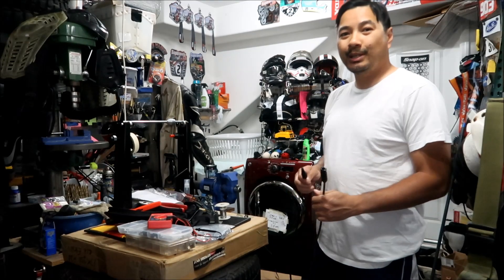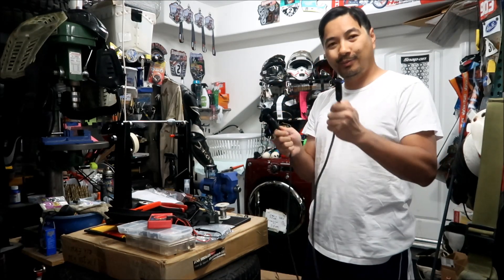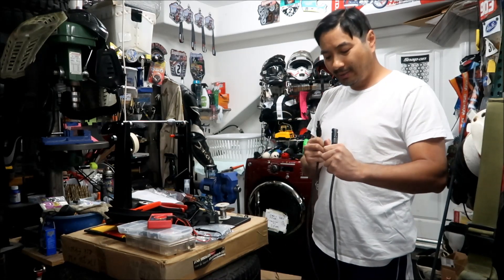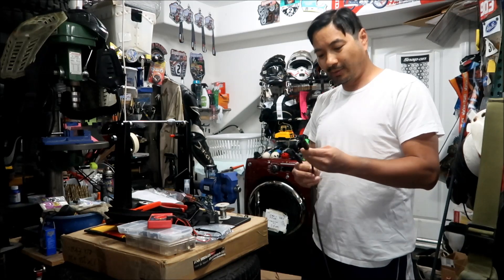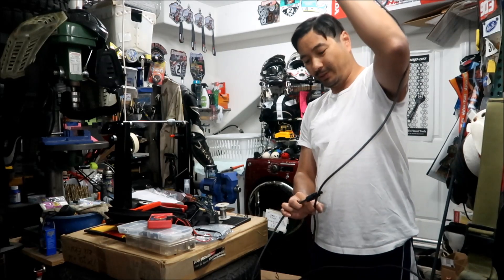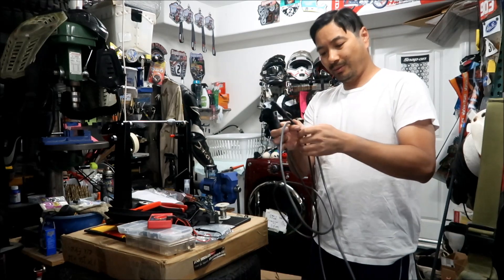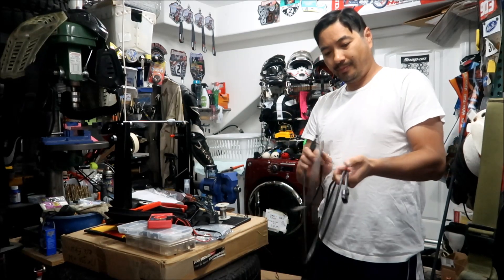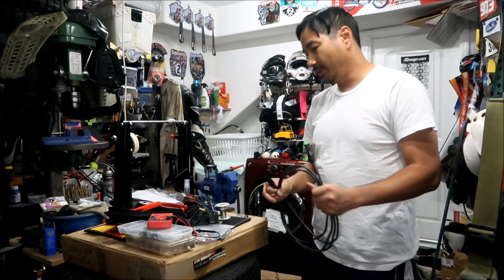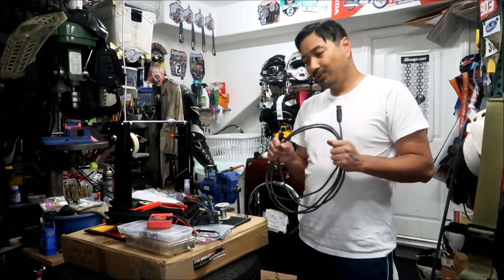I hope you guys enjoyed this episode. So what we did is we made this extension cord wire — one end has a female MC4 and one end has a male MC4, and we tested to make sure they connect fine. This is probably not the ideal cable for solar power because it doesn't bend very easily, but there it is. Be careful with the male end — you could break the clips on it. We used the Bouge RV MC4 crimping kit to do this.